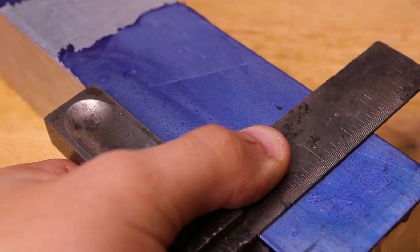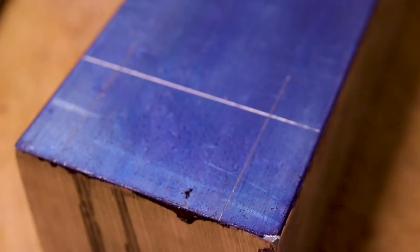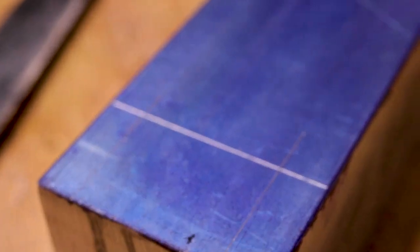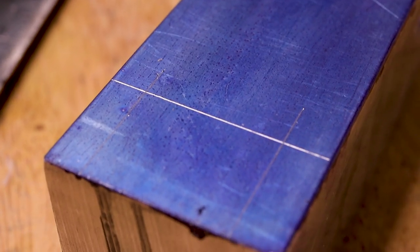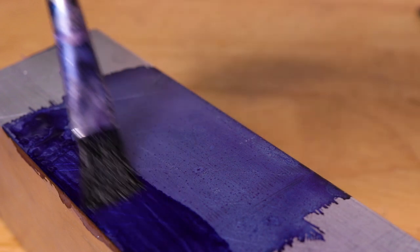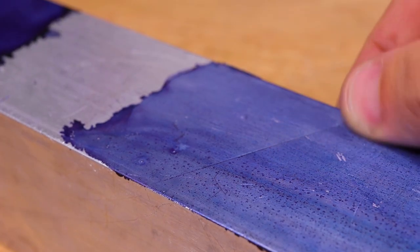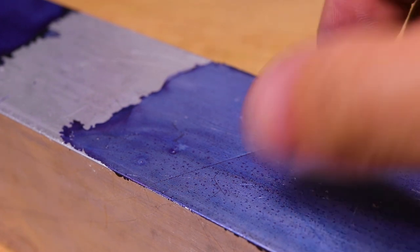The layout fluid that I have here is pretty good. It might not be as saturated as the gentian violet and it may not be as saturated as the permanent marker or off-the-shelf layout fluid, but it provides a great contrasting surface for marking out lines. The dry time, whilst not as quick as the alcohol based marker, only takes about a minute to dry in my workshop which is about 16 degrees Celsius at this time of year. If the colour is not dark enough I can easily apply a second coat which provides a nice deep and rich finish. Most importantly, the shellac provides a very tough and long lasting coating, and vitally the ratio that I used prevents the shellac from forming a brittle coating and cracking when machining.